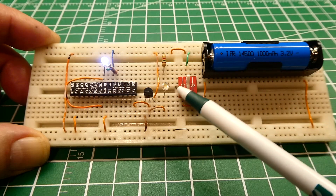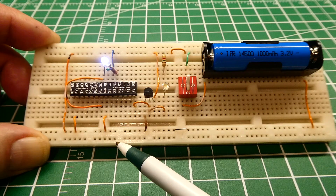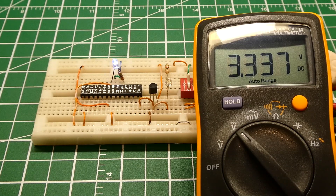We'll take the voltage down until the LED comes on indicating a low battery alarm, which is fed into the microcontroller. I removed the lithium iron phosphate battery and replaced it with a variable power supply at 3.3 volts. I'll slowly take it down and we will see the low battery alarm LED come on, and then the flashing rate on the microcontroller LED will speed up indicating it sensed the low battery alarm.